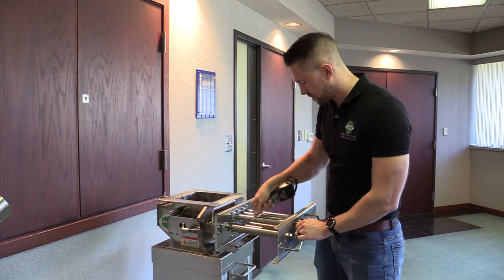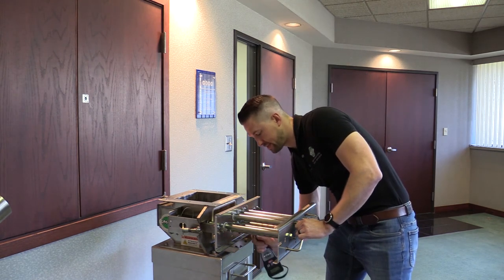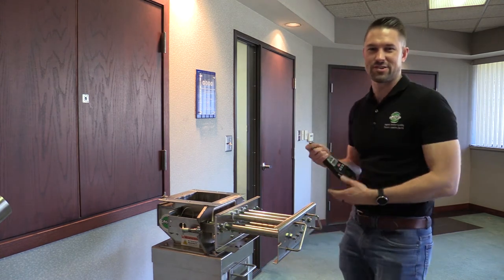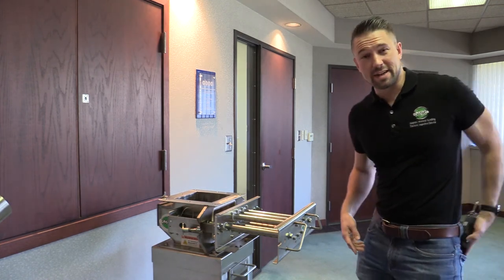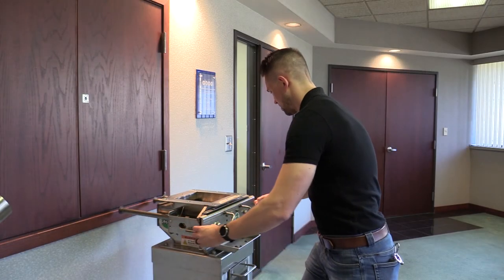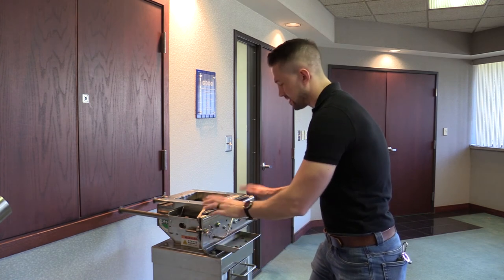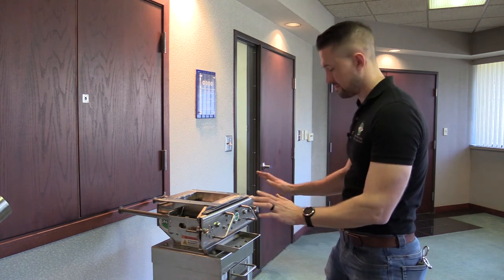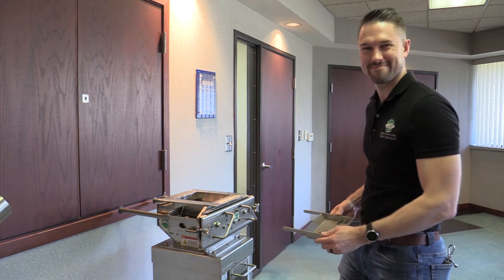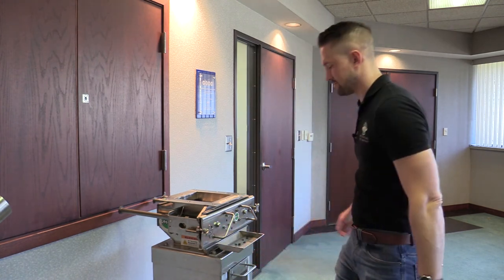I'll quickly check to make sure the rest of the pulls are all good as well, but those three pull values should be a good, accurate representation that the magnetic separator is in all good condition. With my test completed and documented, I'll close up the separator and latch it closed. A nice loose grip is all that's needed to seal this — no death grip required. And then I can remove my tramp metal. That's it.